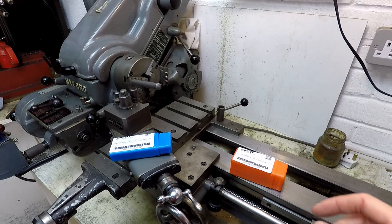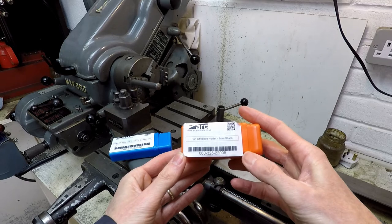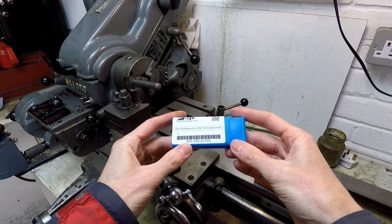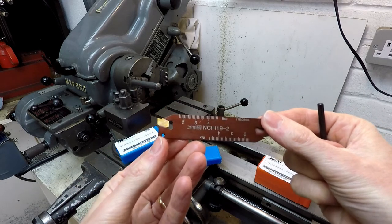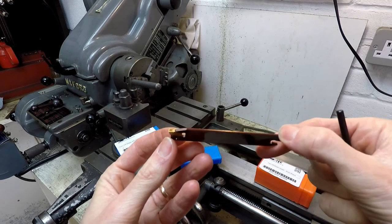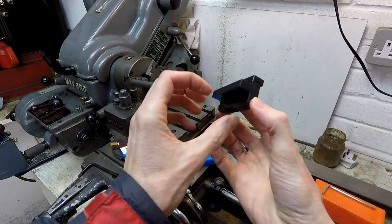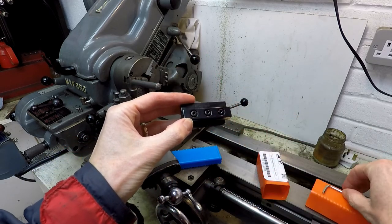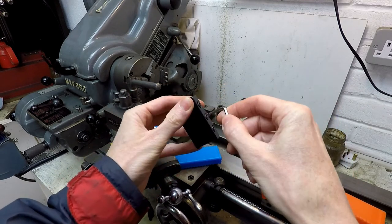The tool basically comes in these two little plastic boxes. This one is the parting off blade holder with an 8mm shank, and this one is the parting off blade itself with the insert. So this is the blade — you can see a little inserted tip there, it's about probably 2mm wide. This is the holder, that's the 8mm shank there. There are three allen keys along the top, and as you would expect there's a little allen key in the box to loosen those off.